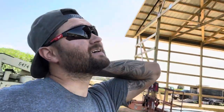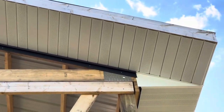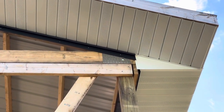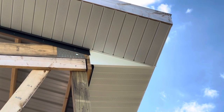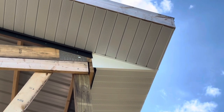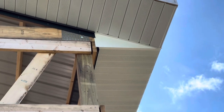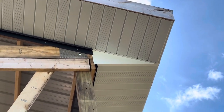Let me walk you through the trim details on the post frame soffit, fascia, and corner. We're going to make up a piece on the brake, go install it in the basket, and then when we do our corner trim you can see how the transition works. We've got our soffit coming down and the midnight gray F&J, and this is always kind of a tricky transition. We're going to do it with some white trim coil, and when the corner goes on we'll have a really nice transition from the rake soffit to the flat soffit. Let's go make up that goofy-looking triangle on the brake and then go up in the air and install it.